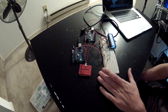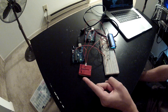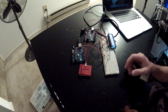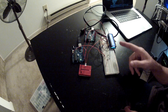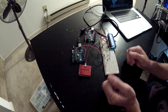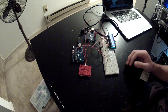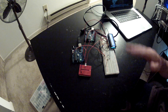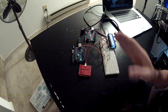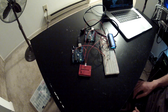To wire this up, you need to tie the TX from one Arduino to the RX of the other Arduino, and then TX from the other to RX - so you're just tying TX to RX, RX to TX. You'll also need to tie the ground pins from both Arduinos together if you're powering them from separate voltage sources. If they share the same voltage source, your commons are already tied together. This is important because your TX and RX lines are going high to low, high to low, and you need a common reference - especially if both Arduinos are running on their own battery pack.